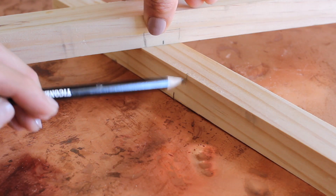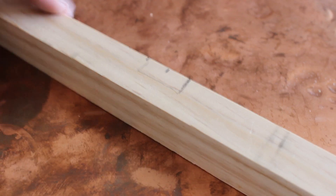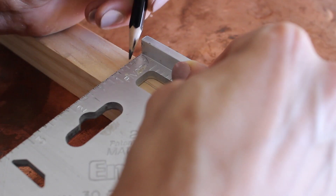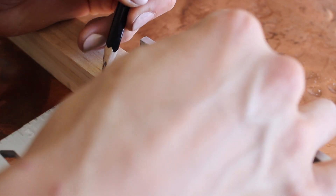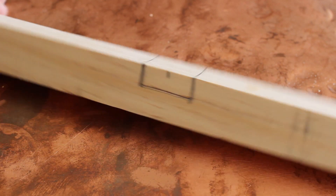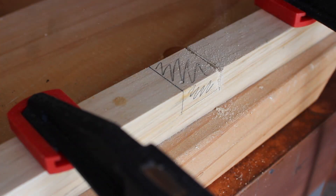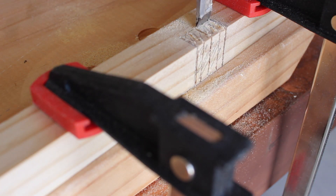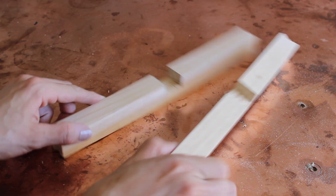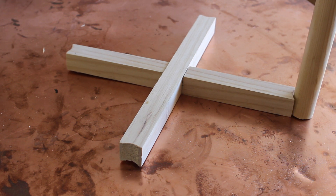Essentially you find the middle of both pieces of wood where you want to create the joint, then cut out the thickness of the pieces you're connecting and chisel halfway down to snug them together. I went in with my speed square to ensure all my lines were nice and straight, and I shade over the chunks I'll be chiseling out — I can't tell you how many times I've chiseled out the wrong piece without doing that. Since this piece is small, I used my multi-tool to carve out the edges, then turned it on its side and used my chisel to take that chunk right out.